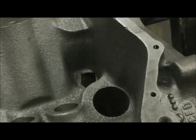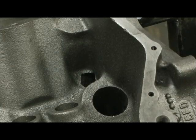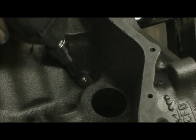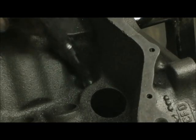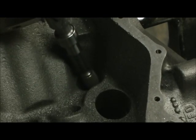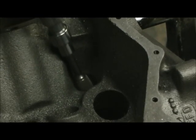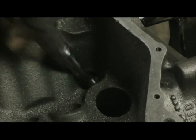One thing I wanted to show you - look how bad that hole is, restricted right there. It's probably not even a third the size of what it can be. And just to show you while you're looking at it, I'm taking just a couple of seconds here - watch. Now see how I'm going in a downward motion, following the path. I'm not just staying on the surface - I'm always following going down in a swoop, just like porting a head.